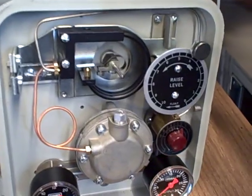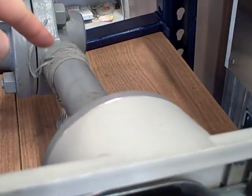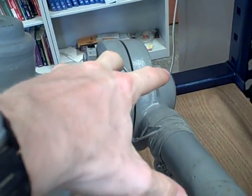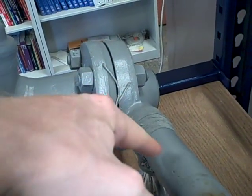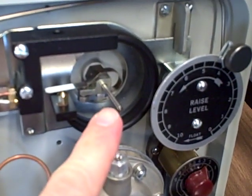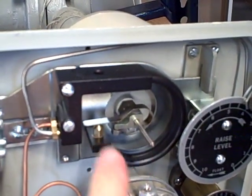At the end of the torque tube, there is a small solid rod that goes in through the long hole in the tube and is welded to the blind end of that hole. When weight is applied to the lever, it twists the torque tube. That torsional force is borne by the length of the tube — it acts as a torsional spring. This solid rod, since it attaches to the far end of the tube and is welded there, rotates as the torque tube twists. The purpose of this small rod is to transfer the twisting motion of the torque tube at the process end over to where it may be measured.